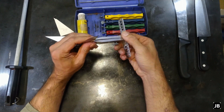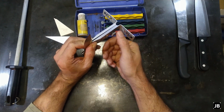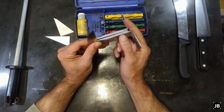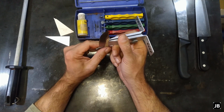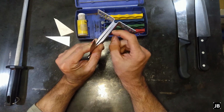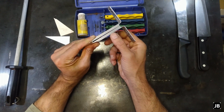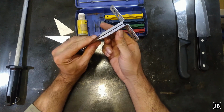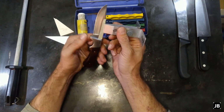You'll see that it goes and sits there, and that gap in the middle of the clamp is not parallel. So what you want to do is set your front set screw so that once you start tightening this down, you keep it as parallel as possible. Now you see there I went over it, so I'm just going to back this off again, tighten this maybe half a turn, one third of a turn, and start opening it up again and clamping it down. Now that's about it. You can see it's almost parallel between the clamp, and now we can start doing it.